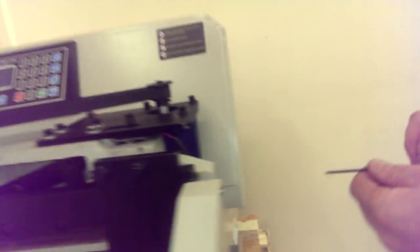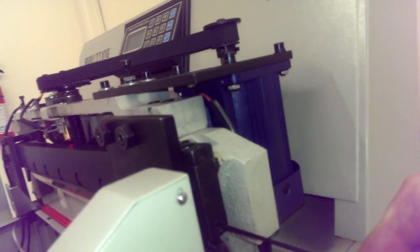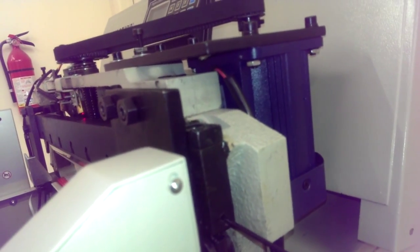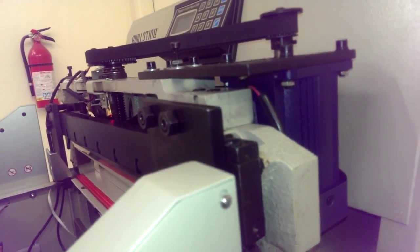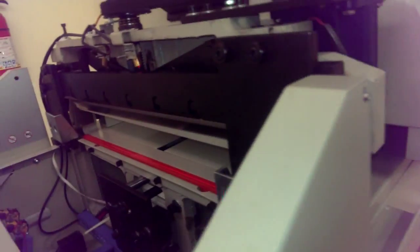One last step. Oh yeah. We need to tighten this 2.5mm Allen wrench down now that we've got it adjusted the way we want it. Just do it kind of snug. It doesn't have to be real tight. Well, actually, it's not supposed to be snug at all because it just holds it in place. So basically, once you snug it down, then just back it up just a hair, because this does have to slide up and down for that nut when you do your adjustment.